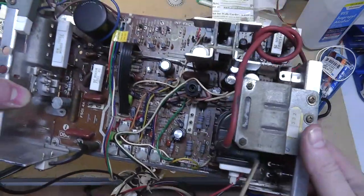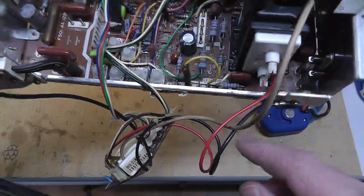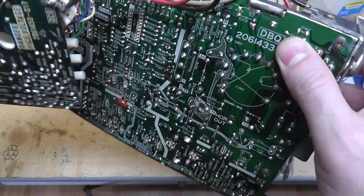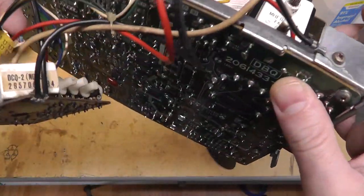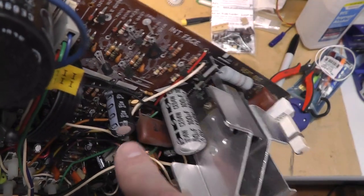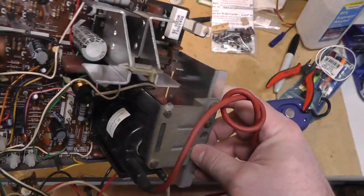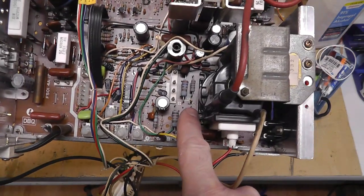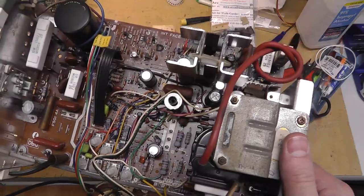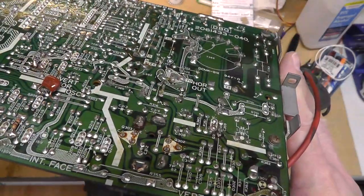All right, I went digging into my boxes of chassis, and this one I had marked working Taito, and it has the dampening pot. It is a dash 40 with a dash 17 neck board, so that's maybe odd, I'm not sure. What's pin 2 there? Pin 2 is okay, not plugged in. I was just looking at something, distracted. But if you look here, maybe you can see it, right behind that cap, it's a 0.15 microfarad capacitor, and it has the horizontal centering jumper cut. So I don't know, this could be a 4903. And I could just put this chassis in there and call it a day. I'm still going to have to do something with the chassis that's in the Joust, but that's okay.